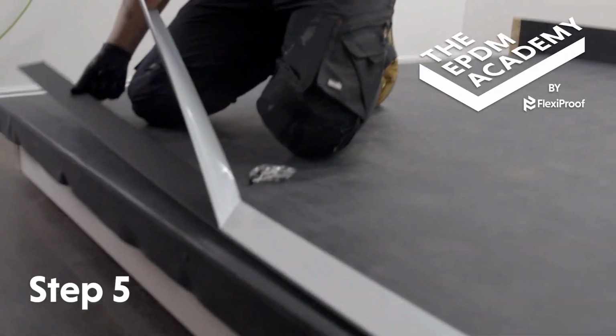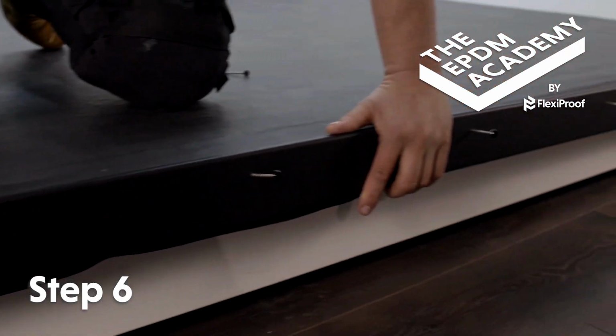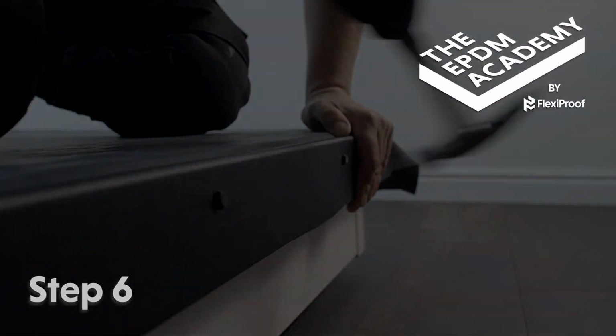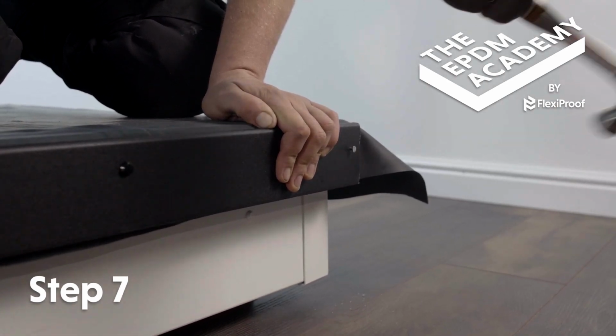Remove the protective film from the gutter trim front plate. Position the front plate onto the membrane-covered backplate. Hammer a PolyTop nail into each of the pre-drilled holes. Hammer a fixing pin into the gutter trim at the corner.